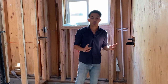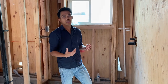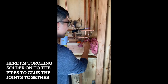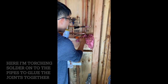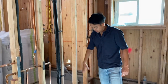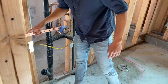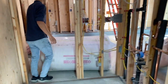A lot of ADU builds will come down with the same problem, so if you're ever thinking of what water heater to use, that's some advice for you. These copper pipings are used for water supply because they're better at transferring hot and cold water. These black pipes are used for ventilation and drainage. The toilet needs some ventilation — it will go through here. The sink has some drainage as well; it kind of goes down here and through over to the kitchen, and the drainage goes all the way down through here.